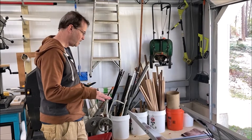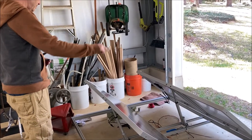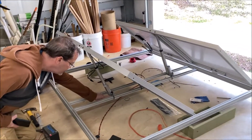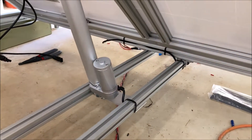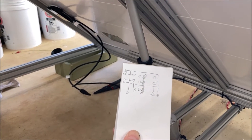There's probably $100 worth of just button head cap screws, stainless washers, and hinges. I had to make these brackets down here — see that plate right there? I had to make that. Here's a drawing for that plate; it's made out of 2-inch by 1/8-inch aluminum.